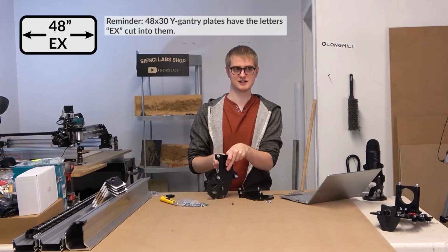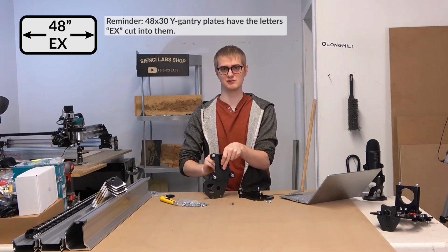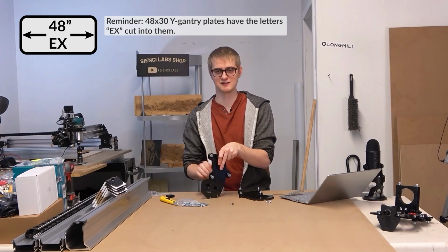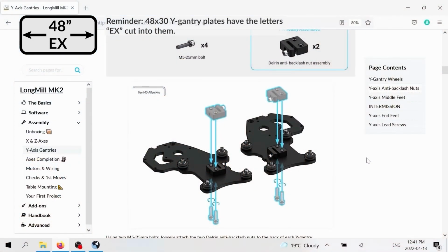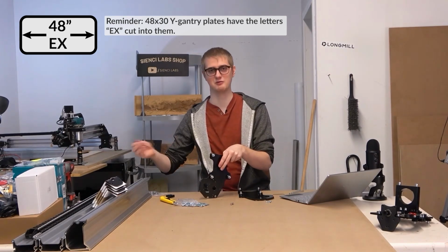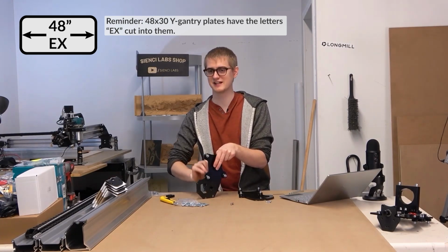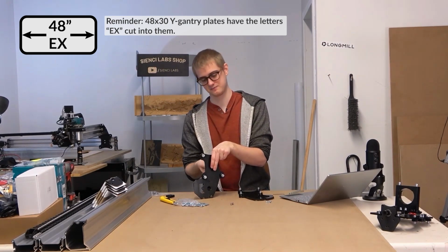You could have a measuring tape, right? If you just buy it from any hardware store, you can buy it for a couple bucks. And that measuring tape is going to be accurate to probably 1 or 2 millimeters. It depends on, oh right, I'm not supposed to tighten these all the way down. Keep them loose. It depends on the measuring tape you buy, and also on how far a distance you're measuring. But let's say you're measuring things that are a couple meters long. You're going to be off by maybe just a couple millimeters max, depending on how cheap you're going, like bottom of the barrel measuring tapes, which is pretty good value.